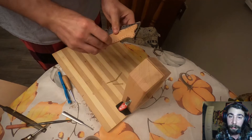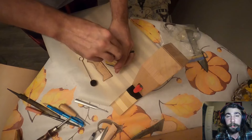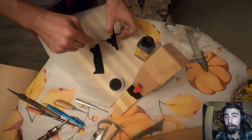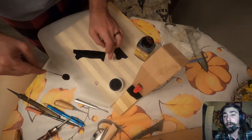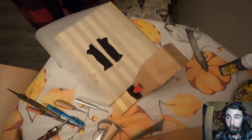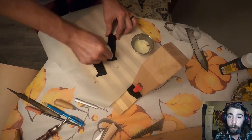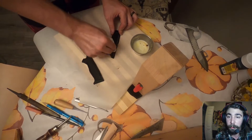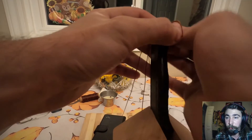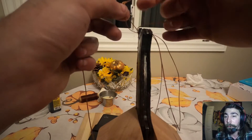I used a bunch of brass nails to align the holes in the knife handle, just making sure that everything would fit fine. I'm using what I think is called Cordovan leather dye — it's kind of a blue and purpley color. I put it on super thick, making sure it's all good and moist. In that metal container I actually have a mixture of beeswax and olive oil — I use the olive oil to make it more like a paste and thin out the beeswax.